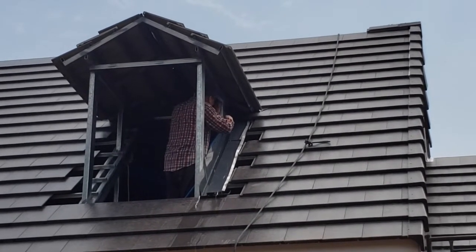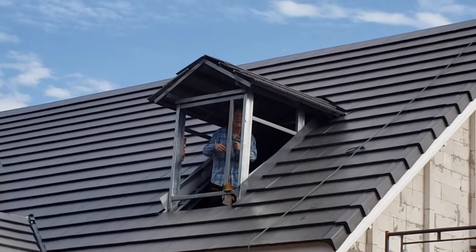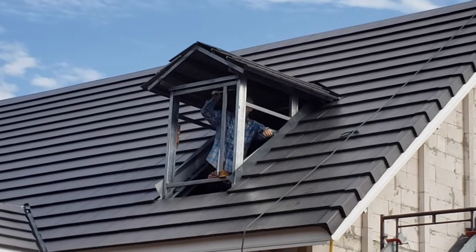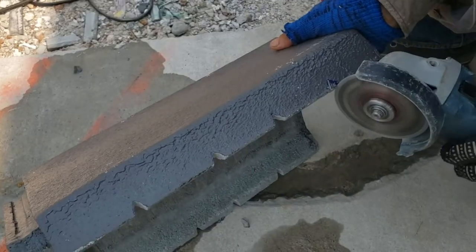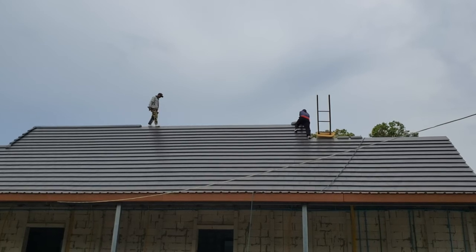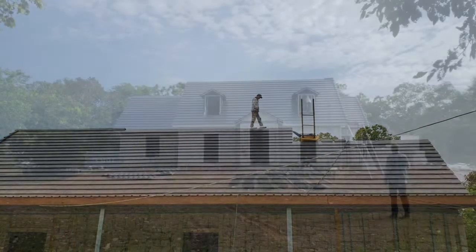Now the eaves are completely finished. We move on to the dormers, who also need to be waterproofed. Ready to receive their skin and window. Before we place the ridge tiles, we cut hundreds of little ventilation openings in their sides, creating a so-called ridge vent. Finally, we place the ridge tiles on top of the roof, and then the casco is finished.